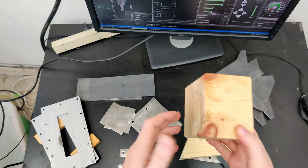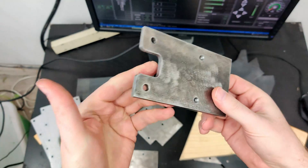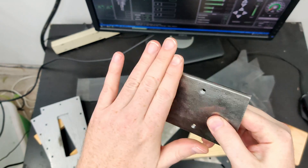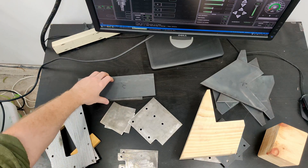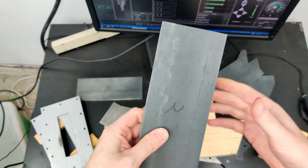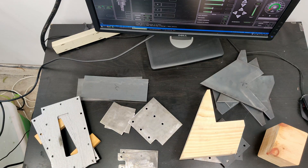Let me know what you think if I should do that or not. What's really left is prepping most of these — for instance, I have to grind bevels into things so when I'm welding I can get more penetration. Some of these I just have to take off the mill scale using a grinder with a flap disc. I'm not going to do the vinegar this time — it's just too time consuming and too much prep work.